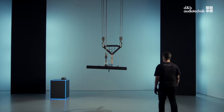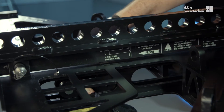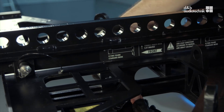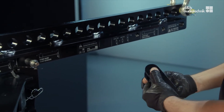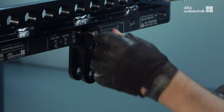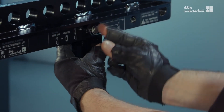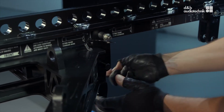To fly SL-SUBS, the load beam has to be attached to the flying frame in standard mode. Remove the rear link adapter from its transport position on the frame and attach it to the load beam. Move the rear link and attach it to the rear link adapter.